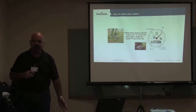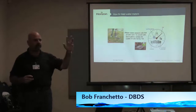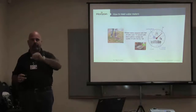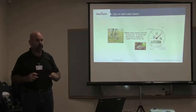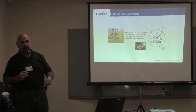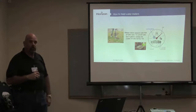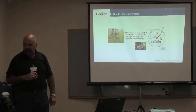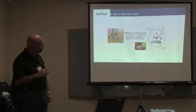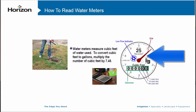Who's been in their water meter — residential or commercial — in the last 30 days? Three, four — good, that's awesome. We get almost next to nothing when I get a raise of hands. I'm glad you're checking your water meters, because first off you've got to know where it is on the site and what it is. That is a huge indicator of what we've got going on. We don't really care about the main dial — if that dial is moving, we've got a big leak.